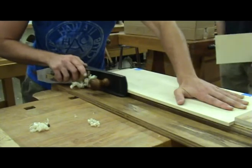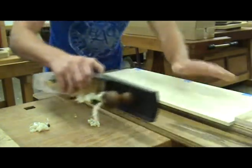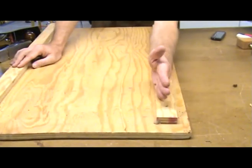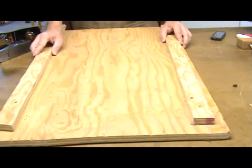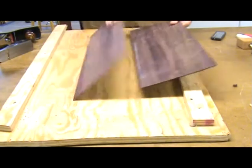Once you have achieved that perfect joint on your top or back, then the pieces need to be glued together. There are many ways to do this. Here is a quick way that I use. I take a piece of plywood or MDF and attach a straight scrap piece of wood to one side of it. Notice that it is angled in from one edge slightly.